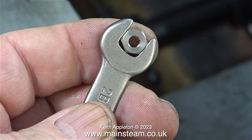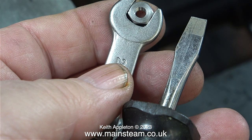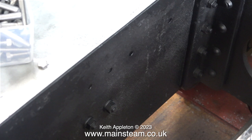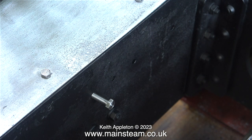Actually, the 2BA nuts are not stainless steel — they're normal mild steel. Once the job is almost finished and the boiler is fully mounted on the expansion joints, I will paint the nuts on the outside of the frames. The right-hand side mounting is held to the frames using three 2BA bolts; the left one has four. Two of these bolts need to be longer than the others, because they go through the frames and through the hand pump casting, then have a nut on the end.